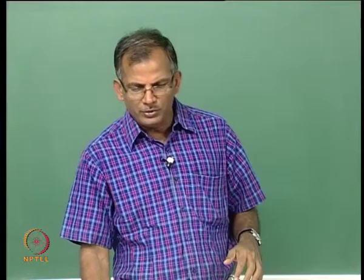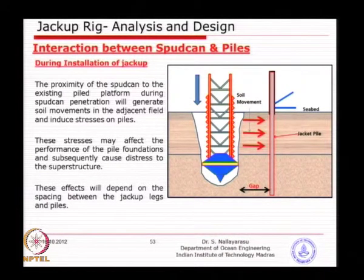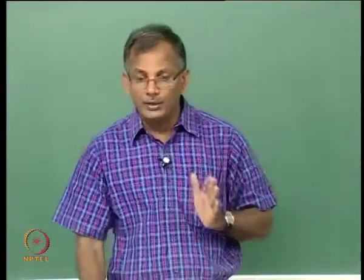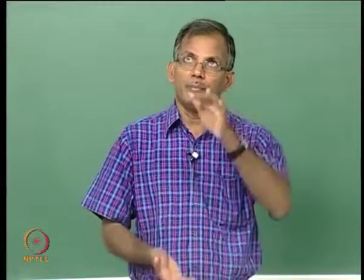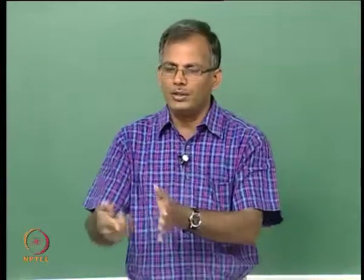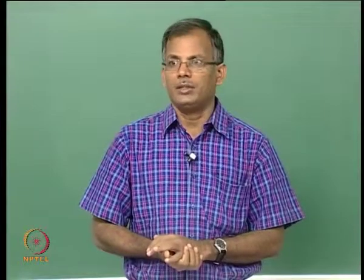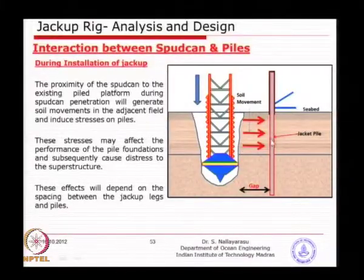Another concern is horizontal displacement of jackup legs due to operational loads. For example, when you have a jackup and sea conditions are coming from one side, with sea waves creating loads on that side — if the jackup does not have sufficient fixity or is flexible enough, it can actually move and create additional soil movement. This can be larger because the jackup is about 60 to 80 meters long and the leg penetration is only small. From analysis, you will see that at least half a meter movement left and right is possible in a simple sea state.